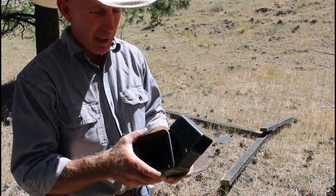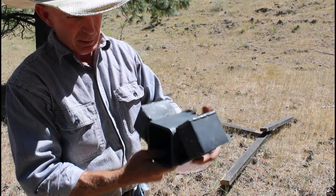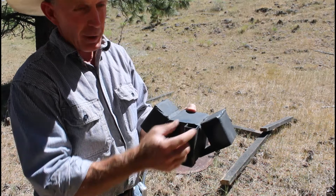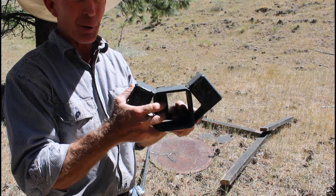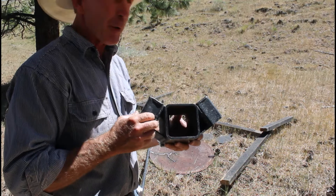I just found a couple pieces of angle iron and welded them on here. I cut one leg a little shorter than the other just to get the right angle. Then I found a couple pieces of 2x4 box tubing, welded an end on them, and then welded them to the angle iron. So now we've got our crossmember sitting in here, with a leg on each side. The last piece of the puzzle — if we want a stand for handgun targets — I welded this box tubing here so that we can put an upright to hang handgun targets. It's a fairly simplistic design. If you know how to weld, or know somebody who can weld for you, the parts and pieces are pretty minimal — just scraps I found from around the shop.